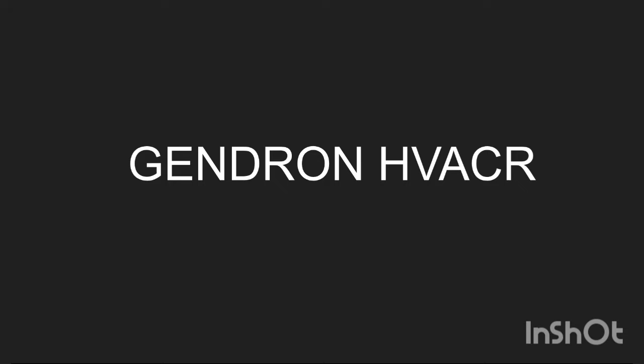So this video is meant to be just a general, like, this is how sight glasses look. This is what a flashing sight glass looks like. I'm going to bounce back and forth between sight glasses and receivers, showing receiver levels and surge tank levels, and kind of telling you how you tell if a receiver is low and how you tell if a sight glass is flashing. Now there are lots of other techniques on evaluating whether or not a rack is low on gas. This is not an extensive video on checking if your rack is low on gas - I have another video that can help, I'll link it below. Like, if you were low on gas, you'll typically have low suction pressure and low head pressure if you're really low. Low suction, low head, nothing in the receiver, and a flashing sight glass, and cases that are temping warm, and then you'll probably have low refrigerant. But this one is just a quick video showing the sight glasses and the different kinds of sight glasses - what is even meant by a flashing sight glass?